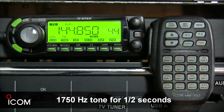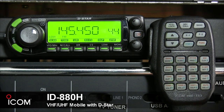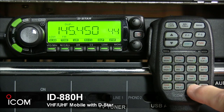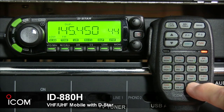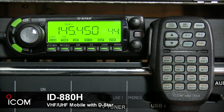The zero button increases the audio output level, or its secondary function sends a 1750 Hz tone signal while pushing and holding. The pound key adjusts the squelch level decrement. Its secondary function locks the digit keys on the keypad, including the A through D, the pound, and the star keys.